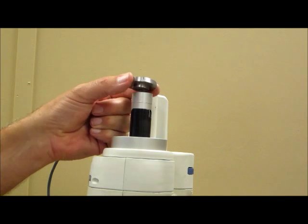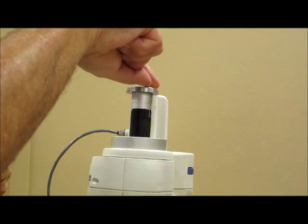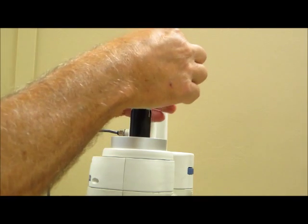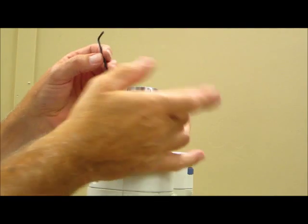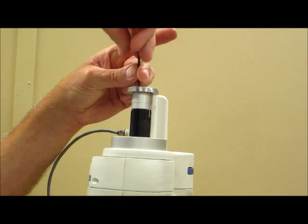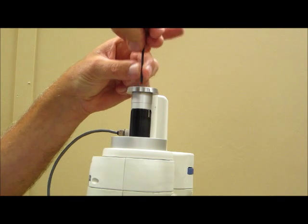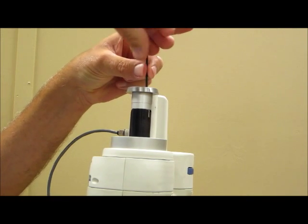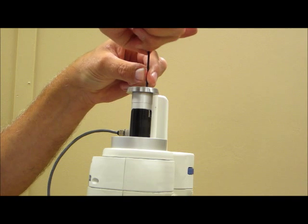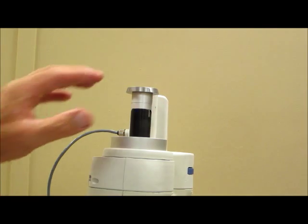Next, place the ram tip on top of the ram sleeve. Utilizing the two 4-40 screws and a 3/32nds allen wrench, line up the holes in the ram tip with the ram extension. It can go on either way — there is no orientation as long as the screws line up, you have it on correctly. Tighten these two 4-40 screws; you'll feel a little resistance because there is some loctite on them, but make sure they're fully tightened. You then have the ram tip installed.